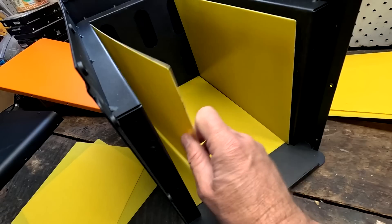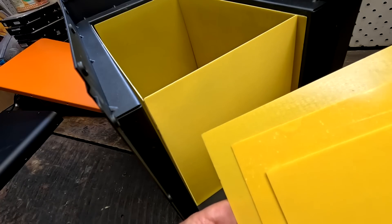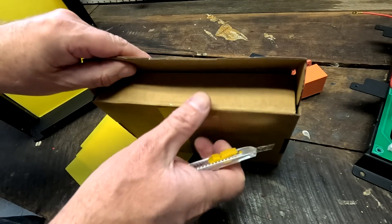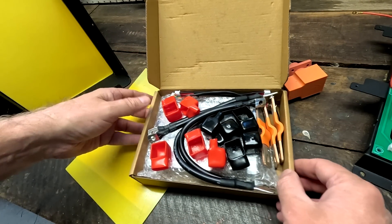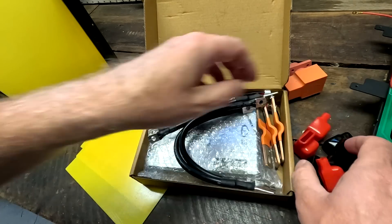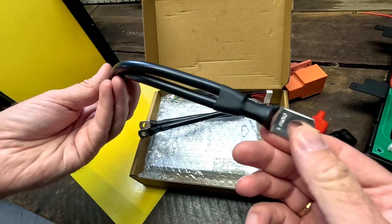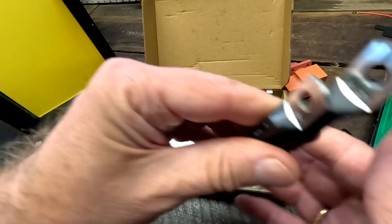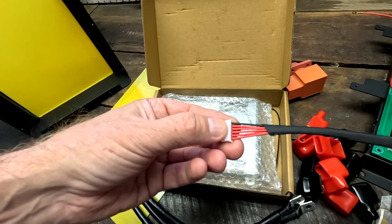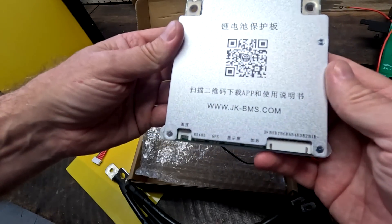Bottom, side, back, front, and three more in between the cells — easy. I haven't seen any cables so far. Opening another box — there they are! Lots of terminal covers, beautiful flexible bus bars, double six-gauge wire connecting from the BMS to the terminals, a power button connector from the BMS to the PCB, temperature sensors, and the 200-amp BMS.